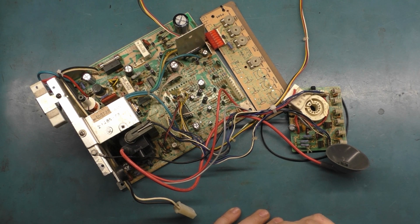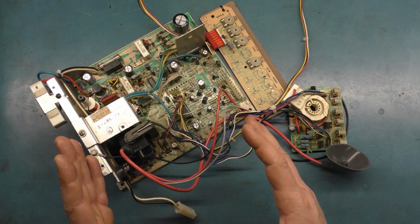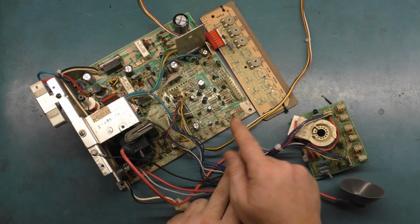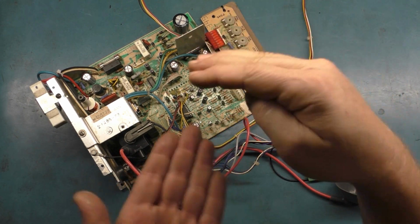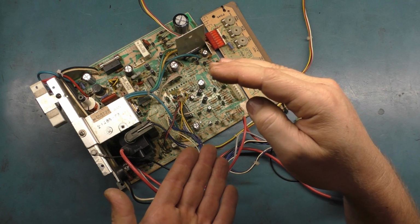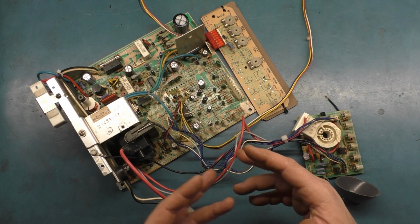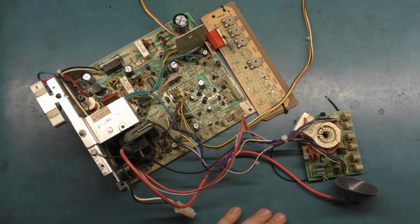So I have the video linked in the description, but if you want a quick recap, this was blowing HOTs because if you turned up the contrast or the brightness too high past a certain point, the screen would bloom wildly. The B-plus would dip from 130 to 105 and all kinds of wild fluctuations. As soon as I hooked up a test pattern generator and just turned it on, boom, the HOT would fry.